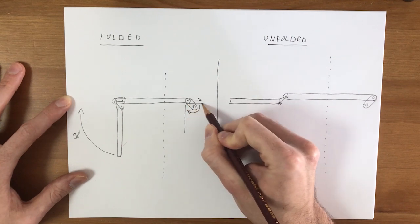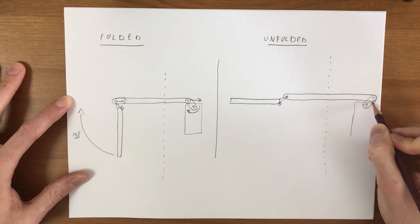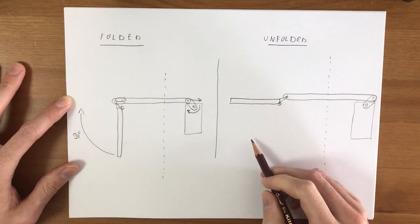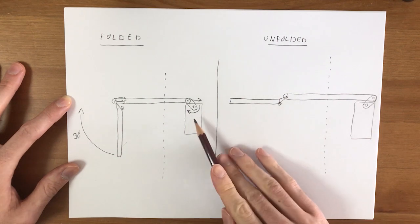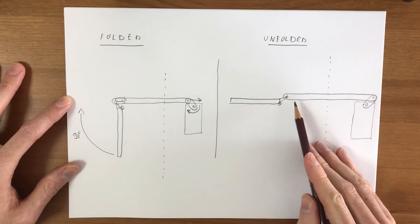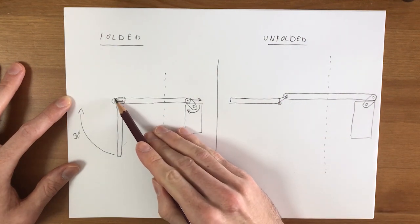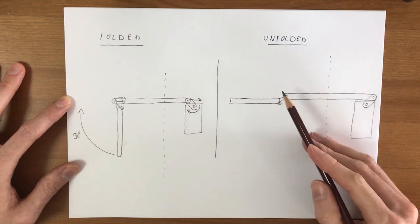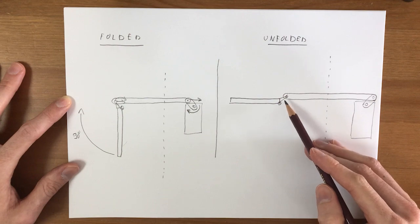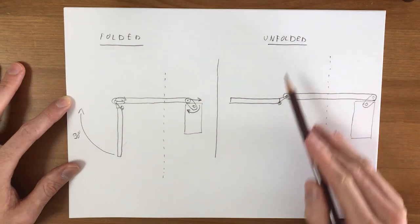And finally, this is the body of the servo motor. By doing this, we have the servo motor inside of the interstage. The part that is visible from the outside is only this hinge and just the tip of the linkage. So this is how we are going to have the fin actuated to create the motion from the folded configuration to the unfolded configuration.